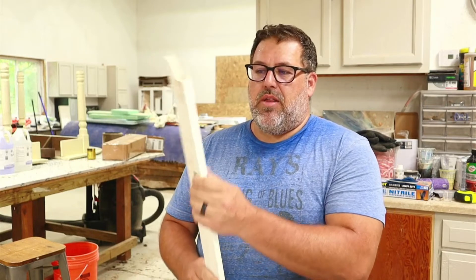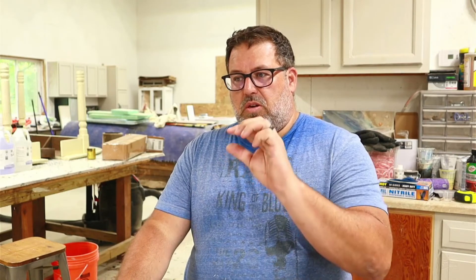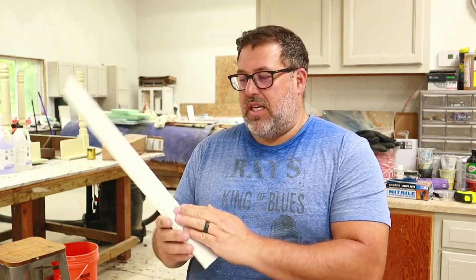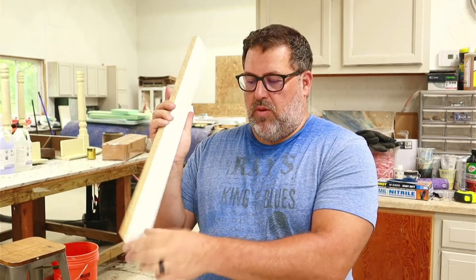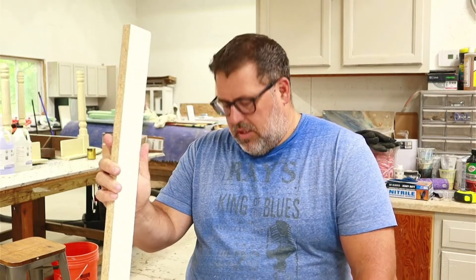I really liked using the PVC board — it's expensive but seemed very reusable and I didn't need to tape anything up. The problem was my charcuterie boards were getting thinner in one spot than others. What was happening, I believe, was that the chemical reaction in the epoxy was heating it up enough to cause it to flex, so I wasn't getting a very good product. With the MDF melamine surface, once you sink a screw into it, it breaks that melamine away and can cause the form to degrade a lot quicker.